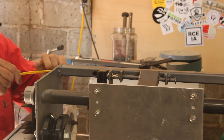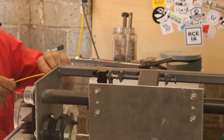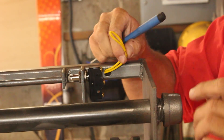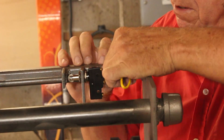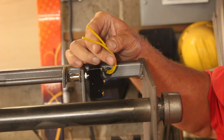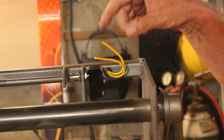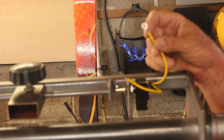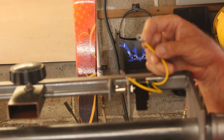We'll start by just fishing the wire down that tube, pulling it right on through. Install the grommet. Now we'll solder a couple of screw lugs on there and attach it to the switch. This crimper will hold the connector onto the end of the wire, but I don't trust it so I always solder it.